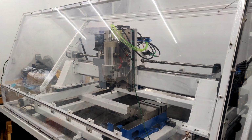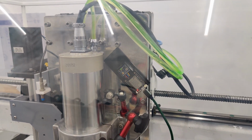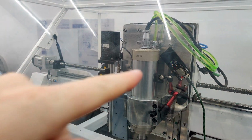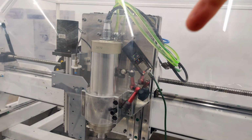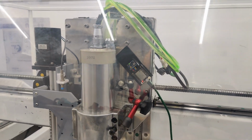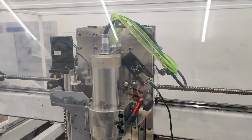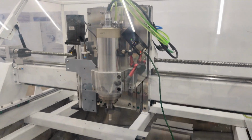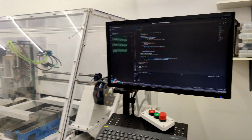And this one should show even better because I'm probably going to omit the z-axis on the accelerometer. The z-axis would be coming out in depth this way, whereas X, I believe, is going that way, and Y will be going that way. Because they both have a gravity load on them, 9.8 m/s², the resolution of those should be a lot better. I find when there's a load on it, the quality of the data was a lot better. So yeah, I'm going to keep running this for probably an hour, maybe more in total, and we can check it out.